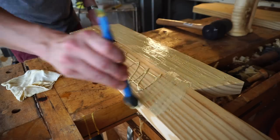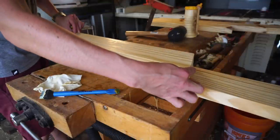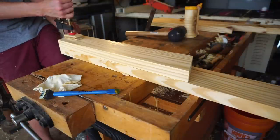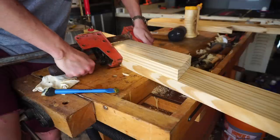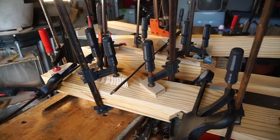The glue up consists of a piece that is significantly shorter than the other, which creates a lap that the apron will nest into. That apron that is covered in dog holes is one of the signature pieces of the Nicholson and creates an endless amount of work holding options for the user.